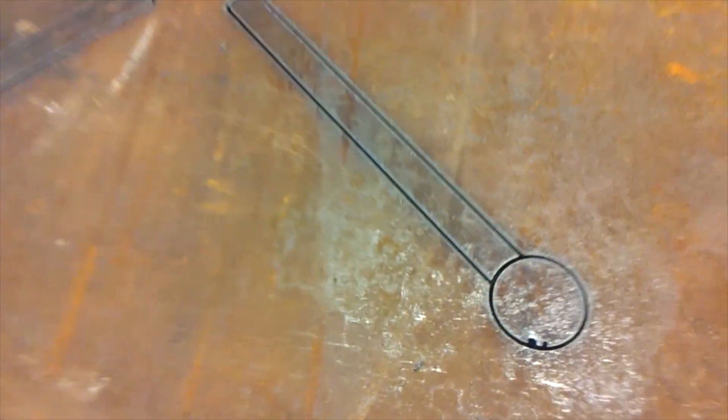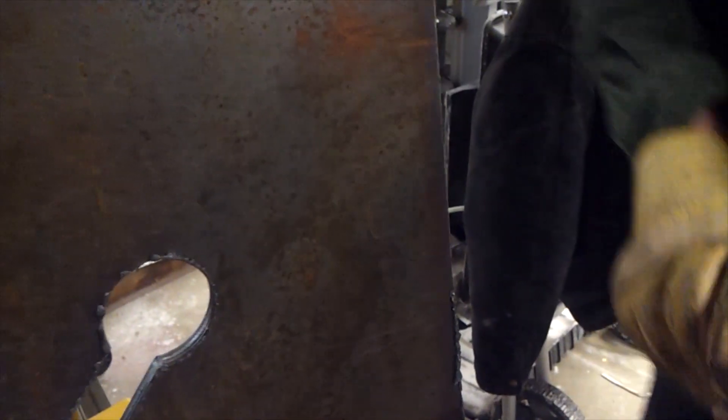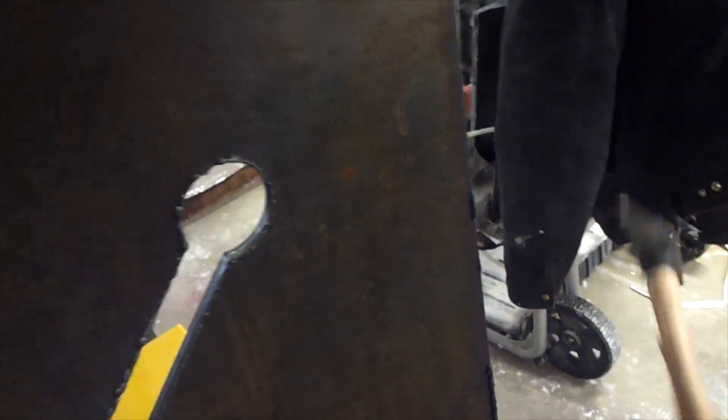So the cut's finished and we'll just have a quick look at how it's worked out. The kerf is about 65 thou — I've measured it at the moment. I'm still playing with the settings, tweaking as we go along, making sure the bevel of the cut is acceptable. We're just going to chip the dross off the back of the plate — very easy to break away. You can either use a paint scraper or chipping hammer as you see here. The Hypertherm PowerMax series of plasma cutters are very, very clean if set correctly, and I think they're probably one of the best plasma cutters on the market.